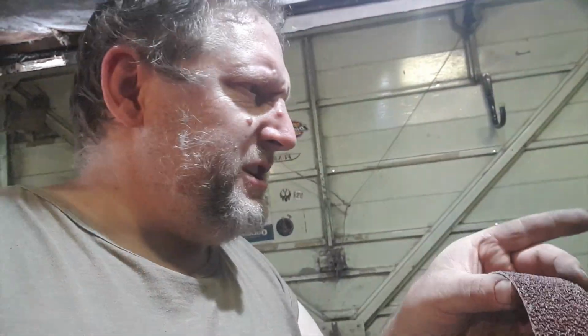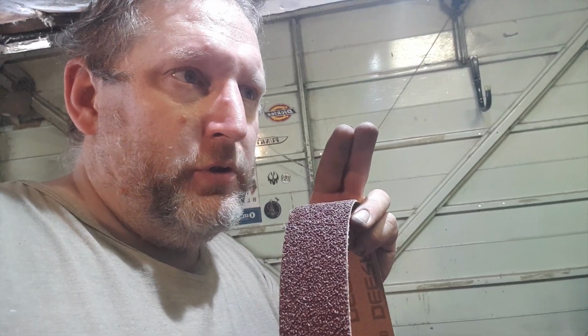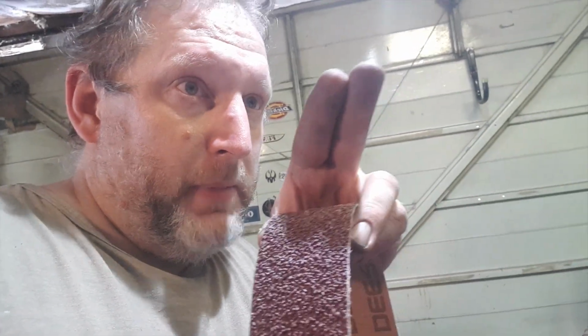This sat really well, hardly any crowning. My machine's not great for that. So what happens occasionally is you put the blade on, but the center of the belt is crowned out ever so slightly. So you've got to push it in, so you're not going gently on the belt. Yeah, it seems spot on for me, what I wanted, and I know it's going to last a long time.